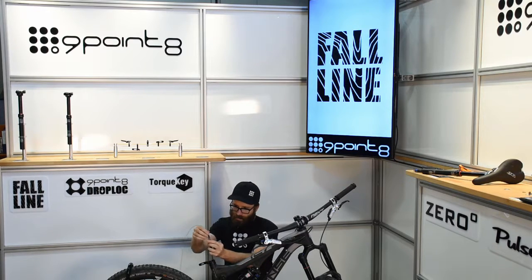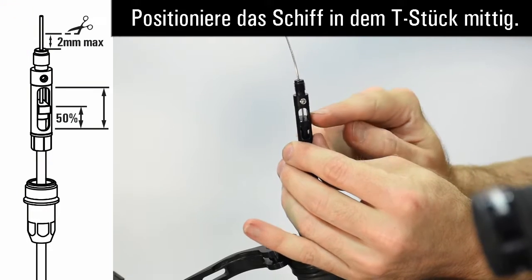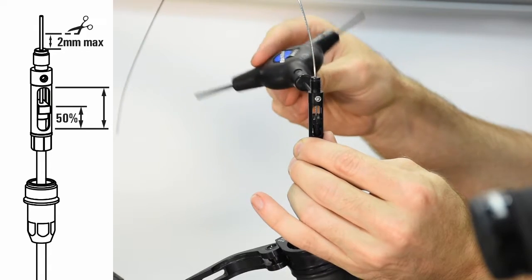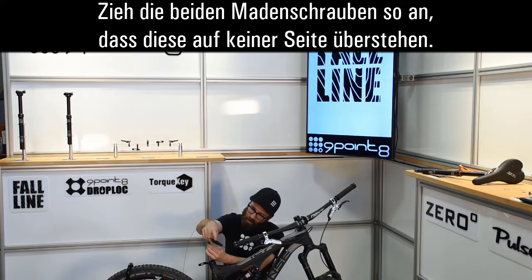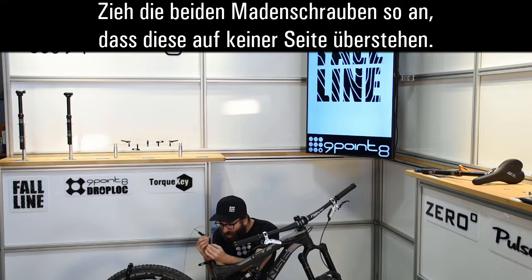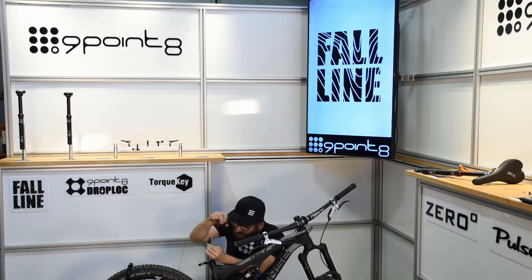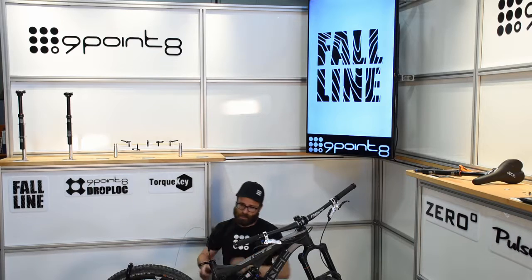Now, this is a crucial step. We need to position the T-nut so that it is at the halfway mark in the slot. Then we'll tighten our two cable clamp screws — that'll be a two millimeter. Make sure that they're tightened from both sides such that the set screws do not protrude, so just wind them in a little bit from each side. When you're just a little bit snug, check your position again and make sure that you're at the halfway mark before you tighten these up. Run your fingers along the outside to confirm those set screws are not sticking out.